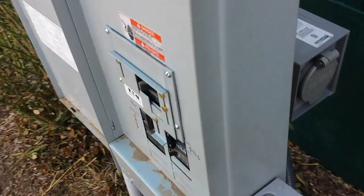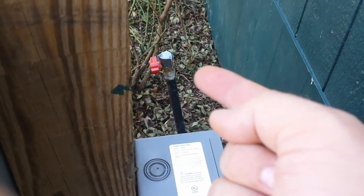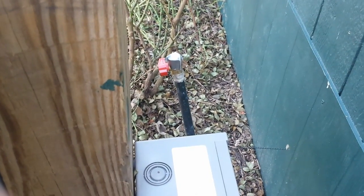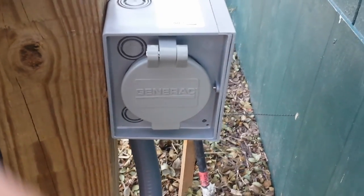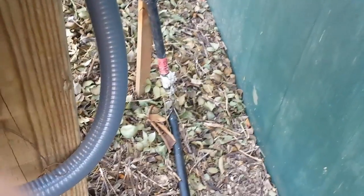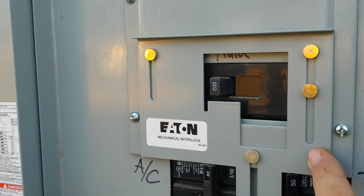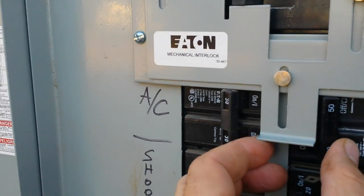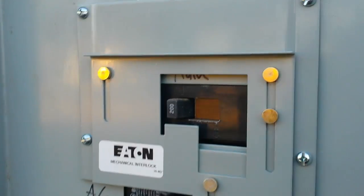We got it all finished. We've got the gas line ran. We just need to order an adapter to go to a propane tank type connector because that's what's on the generator. We've got our inlet box installed right here. They'll get the cables on order with the generator — it plugs into the 50 amp on the generator, and then there's a twist lock that plugs into here. I ran conduit and 8 gauge wire down and up through into here, put in a new 50 amp breaker because that's what we'll be running to feed the panel. This is the interlock — you can't flip this breaker on until the main breaker is off, so it doesn't go back up into the grid.